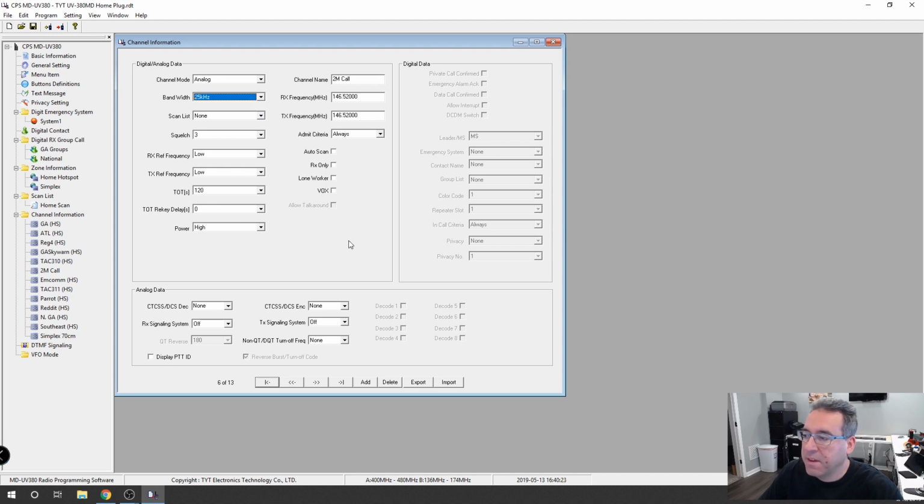And the same things apply. Your channel name, your receive frequency, your transmit frequency. Here's your tones. If you're using tones, again in the admit criteria, just like we talked about a bit ago for the digital, you define your admit criteria. And then here's your transmit. So you set up your tones if you're doing tones for transmit. Transmit signaling system, if you're doing DTMF tones, you enable that there. Receive signaling, again, if you're doing DTMF tones. And for receiving tones to unlock the radio, you configure those here as well.